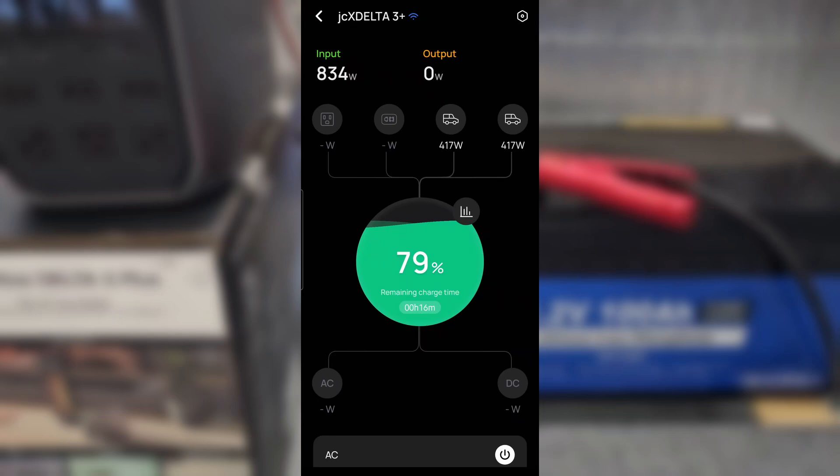The reason is that the knockoff cable I bought from Amazon says XT60i, but when I checked the center pin, it doesn't really connect to the negative wire. So the 'i' intelligence doesn't really work. If that were connected, I'm guessing we'd be pulling the maximum allowed current.